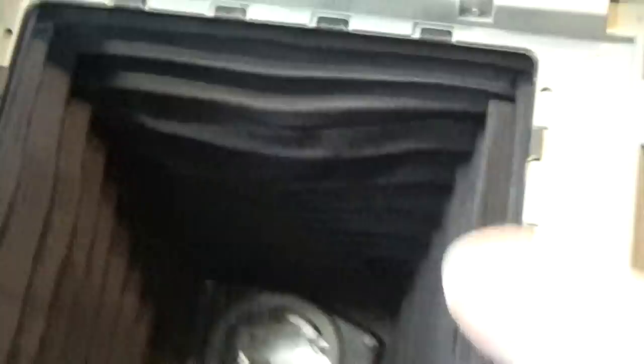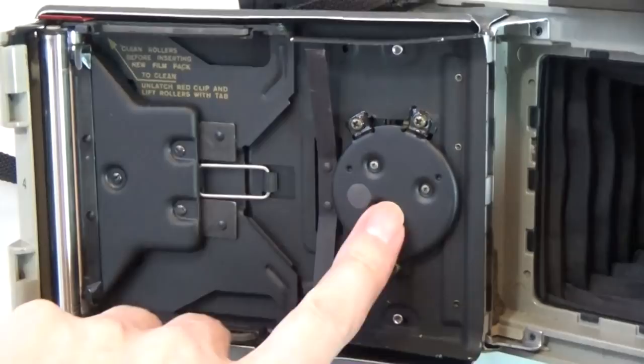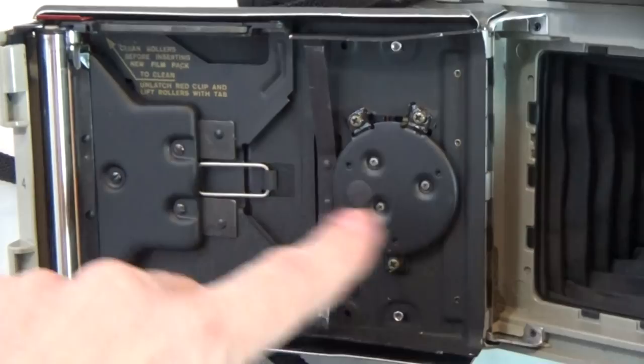I can feel how the fabric and the rubber are separating — I can kind of feel it pushing against the rubber portion. I don't really know what the solution is. I could either replace the bellows, or find a way of re-tacking it somehow — might be able to inject some glue between the two layers and push it up. That is definitely the problem. I might have to just put something solid in there. You can see the inside mechanism there with the shutter inside. Also visible is the timer that doesn't work on my camera anymore — I could take that apart and clean it out, but there's really no point, I don't use it.